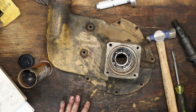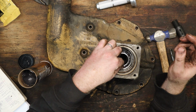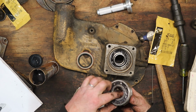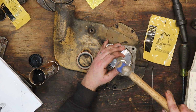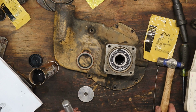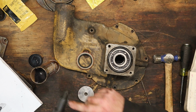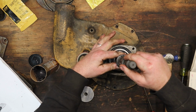Next up, we have spacer. This guy here, I believe. Our bearing just goes in next. Okay, we got our next bearing packed. It should just sit down in there. Must be bottomed. A little smidgen of grease here. That goes right there, like that. Then our shaft, I'm gonna give it just a little grease to help ease it in. And that should go in like this.